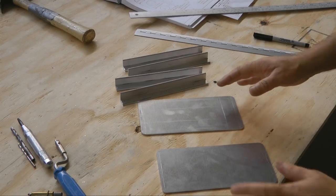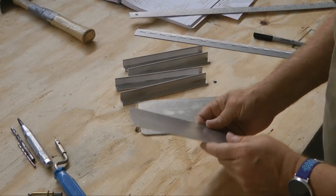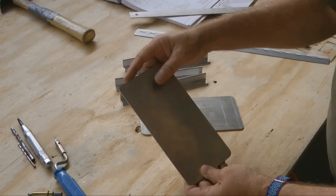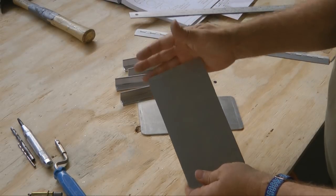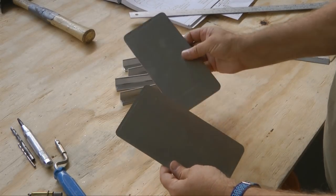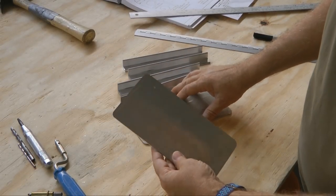Now we're going to fabricate our own rudder pedals. Starts out with a couple of sheets of 90 thou aluminum, and I cut this out 4 by 8. Check your plans. Also rounded the corners because these will be sticking out and you don't want someone to get jabbed by a corner. Most important at the top. And of course notice I have 2 of everything. We got 2 rudders. We got 2 feet, excuse me.